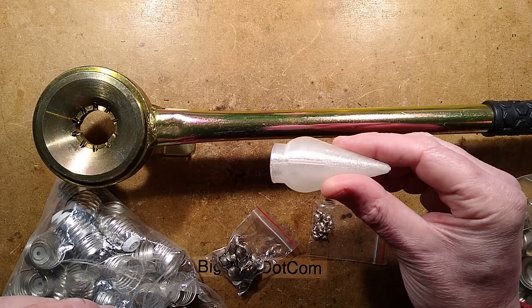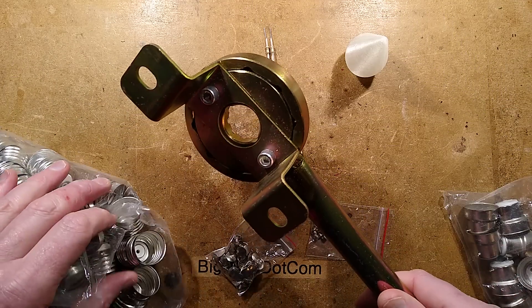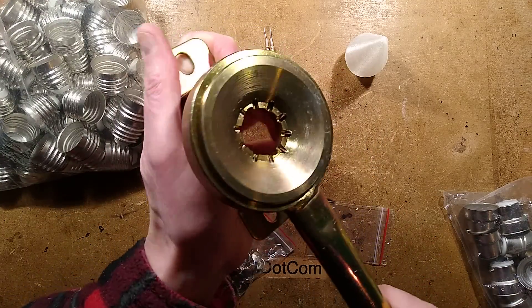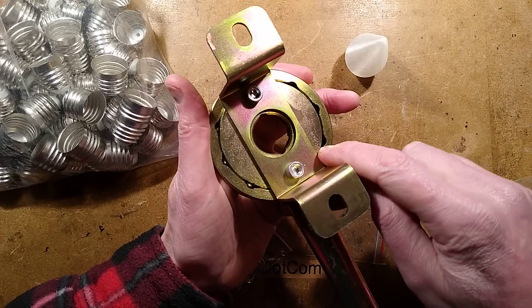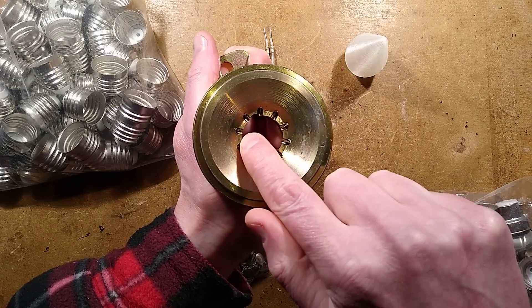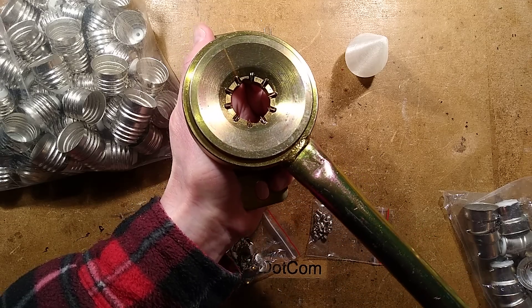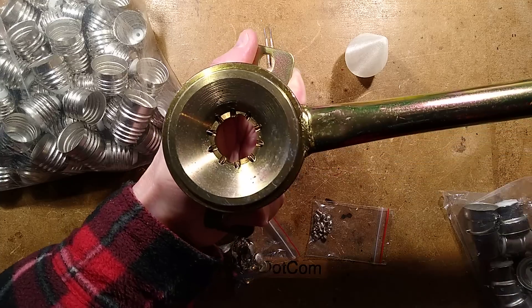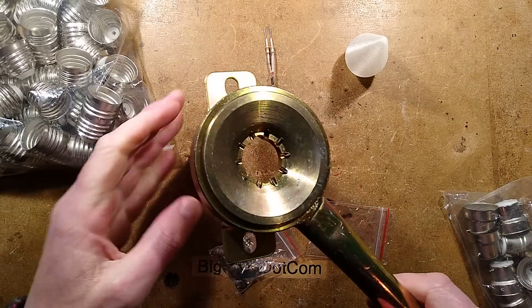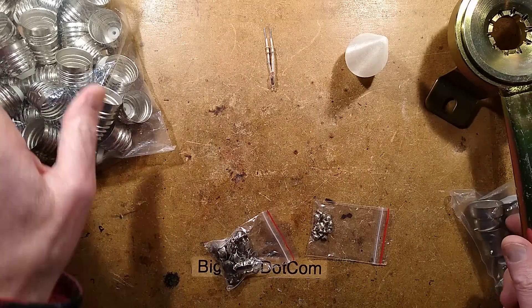Here is a suitable lamp cap that I've just 3D printed and I'm going to put a neon into it. The construction is quite interesting. It's designed to be bolted down and the operation is simple - it's got these little indents around the outside with ball bearings riding them with springs. As you turn it, these little spikes go in and pop back out again. It doesn't matter what direction you turn it or how many notches - each notch is a crimping action.